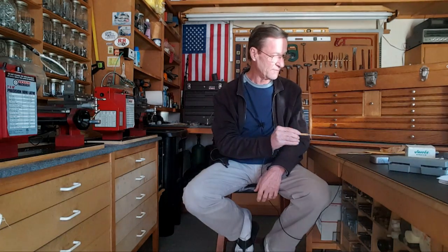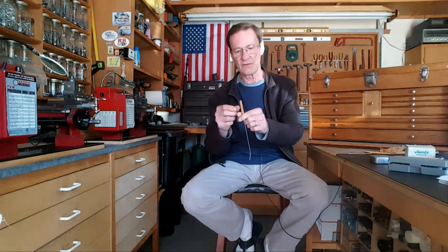The other thing that was in there was this guy, because I realized in some of the videos I need a little pointer to point at things as I talk. So I decided to make my own, since looking for dental tools and all that were rather expensive. This is easy to make. This is just junk pine. I'm probably going to make a better handle out of mahogany or something. I had a ton of stainless steel welding rod, so it's cut, put in the grinder in a cordless drill, and then run on the side of the grinding wheel to get a nice point to it. And then bend it, make a handle, freehand a fancy little knob on here, and poof, I got a pointer. Might be too long, I don't know, but for now, it's great.